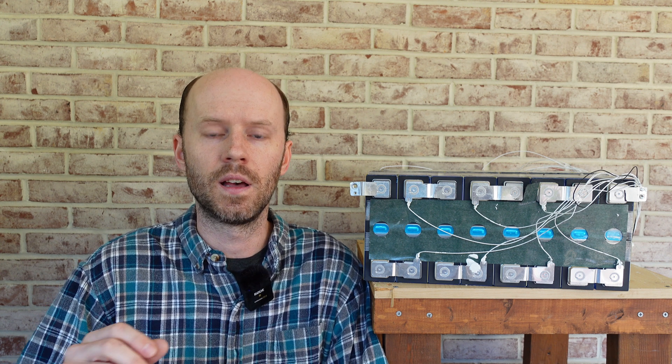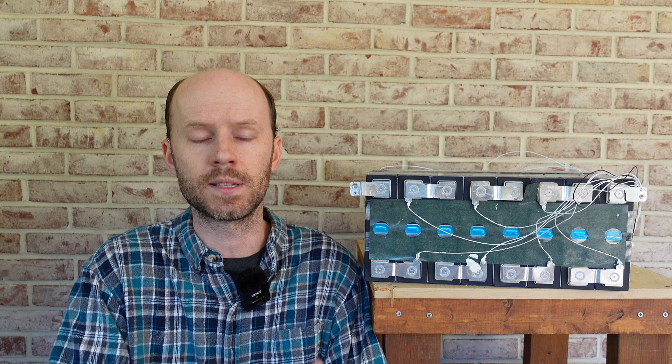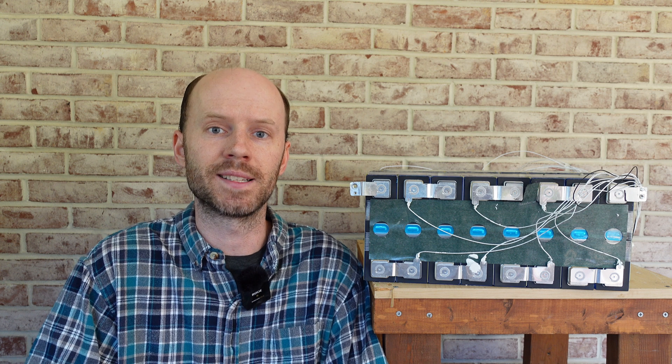Some viewers did say I should be running more than one capacity test during these reviews. Here's the deal: if I take 10 batteries — 10 different brands or models — and capacity test them all, and nine of those 10 exceed the rated capacity on the first test but one does not, I can't simply discard that one test result and run a second test because I don't like the first result. To me that makes the review biased, and I'm here to review these batteries in as unbiased a way as I can. So if one battery out of 10 tests low on the first test, I'm going to report that. I'll most likely do a second test and try to find the cause, but I'm going to put less emphasis on that second test result, especially if I manipulated the battery by doing balancing or any other changes before running that second capacity test.